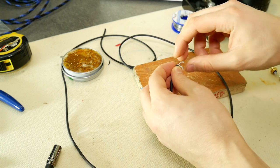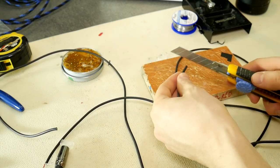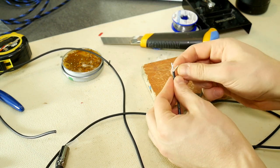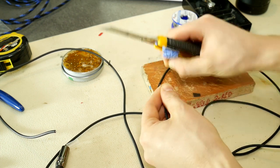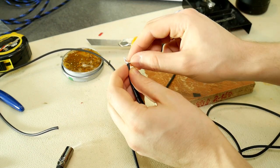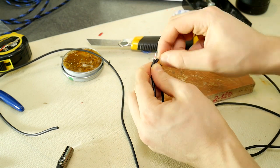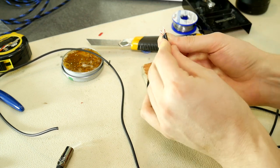Twist all the separated metallic shield wires into one braid. Then remove the plastic insulation on both center wires, about 2 millimeters — no more than that. Twist the two center wires together to obtain a larger center wire cross-section. Then do the same with the other end: remove the outer insulation, separate the shield from the center wires, twist them, remove the insulation from the center wires, and twist the two center wires together. Then take the first wire, put it on, and twist the shield wires of both wires together. As a result, we have two wires with three cores: shield for ground, and left and right cores.